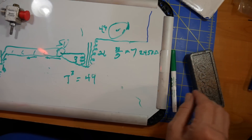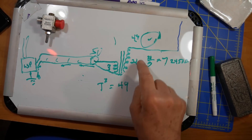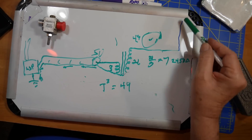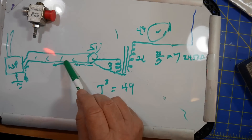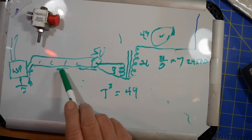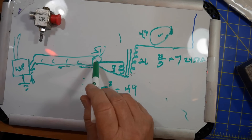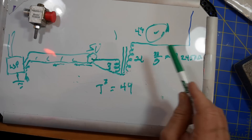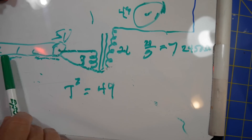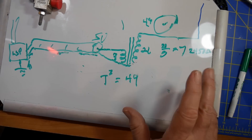That's what I recommend. Don't make this a 10-foot piece of coax — make it 30 or 40 feet. Then you don't have to worry so much about what's going on in the balun. The energy will go in here, come back in here, and kind of hold itself in a capacitive holding in the counterpoise, then go back out again. Now you do have to do something — you can't just connect it. And one thing you definitely don't want to do is put a balun right there, because you want to use the outside of that coax. It's a 49-to-1 impedance ratio un-un.